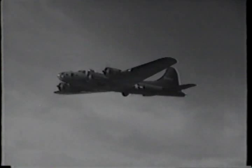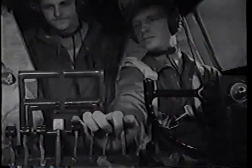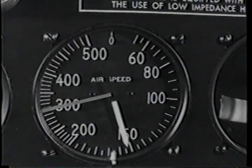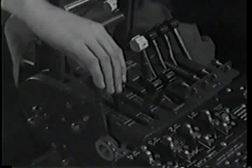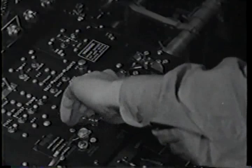You level off at 10,000 feet and cut her down to the proper setting for maximum long-range performance on 91-grade fuel. Manifold pressure down first to 28 inches. RPM next. You make this adjustment with one eye on the airspeed indicator because you use whatever RPM needed to get 150 miles per hour indicated. In this case, with your conditions, 1600 RPM. Then fuel mixtures to auto lean. And your co-pilot closes cowl flaps since you have a safe margin in head temperatures.